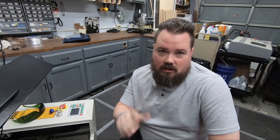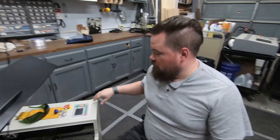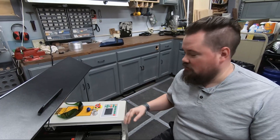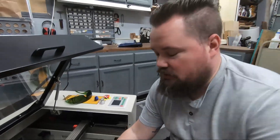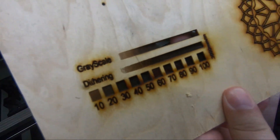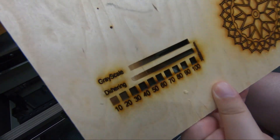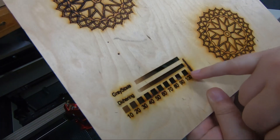All right, so that's it — finished. First off, I know the power was way too high for that. You can adjust the max midway through but every time it goes to a new level it changes, so you'd really want to fix your files. I mean it cut clear through — even at 60% it was way too high. It's awesome though — this is the best, smoothest cut we've ever had on anything. I did turn it down for the last two layers, that's why it didn't go through.